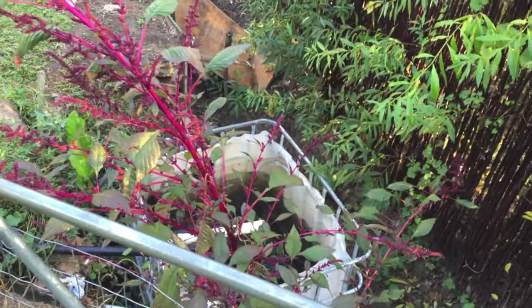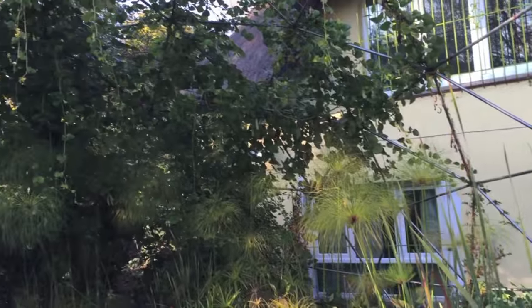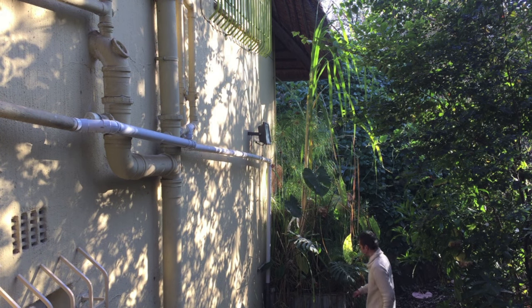There is the collection drum where the water gets collected after being treated. I've put a lot of aerating plants in there and that's why it looks dark. Right behind me is the wetland that's gone on steroids from the grey water we've diverted — it has reached 5 meters tall. Believe it or not, this wetland only takes 1.2 square meters of floor space, has reached over 5 meters tall, and it's cleaning 16,000-plus liters of water per month, consistently, for a year and a half. This is what it looks like in the middle of winter — it is thriving.